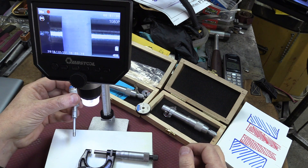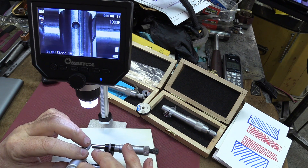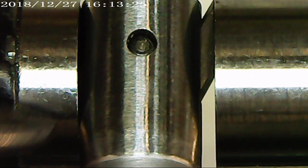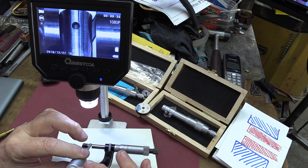As opposed to the quality micrometer — we're all set up here. If I try to move left and right, the whole assembly, including the micrometer's jaws, comes along with it. See how solid this is in there? There's no pivoting point at all. The two surfaces are perfectly lined up. That's the difference — probably a $500 or $600 instrument compared to the much cheaper one.